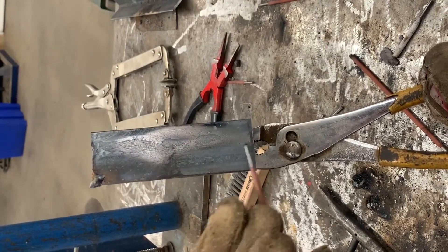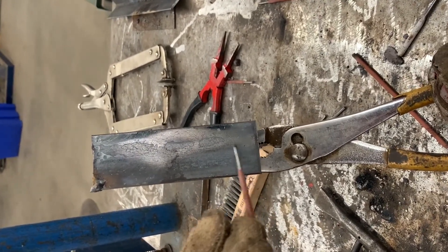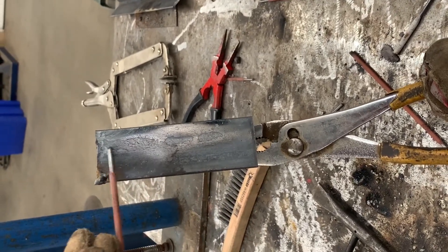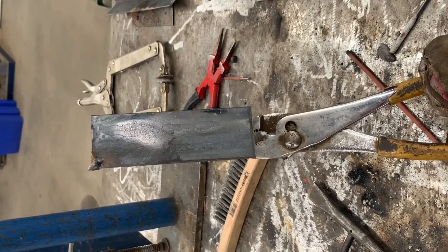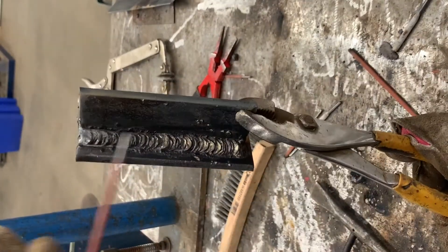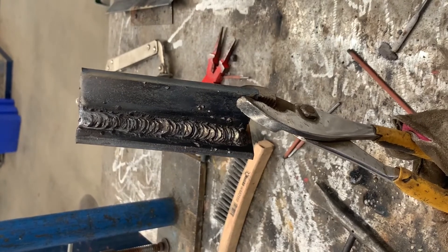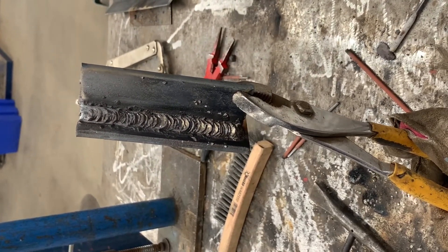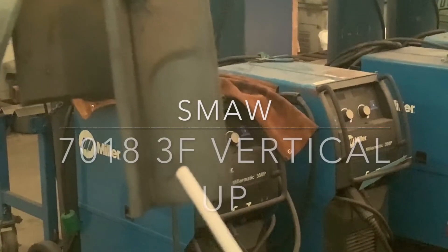So there's the bottom — you can see even at 90 degrees the heat marks are a little faint. And then we corrected it and brought it down. We still get heat marks more at the top because when you're vertically welding, the heat's going to transfer all the way up to the top. So there's the 6010 vertical up — and the 7018 vertical up.